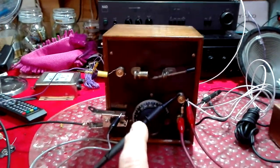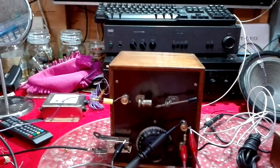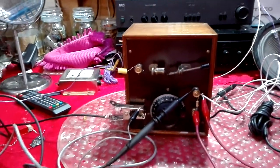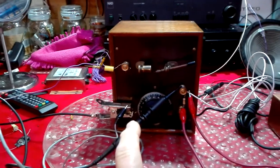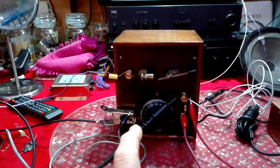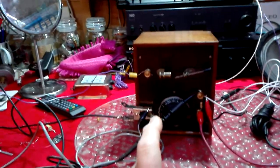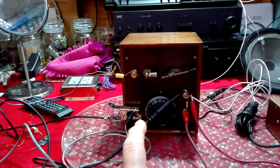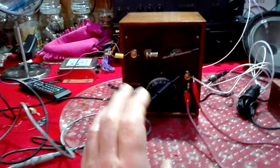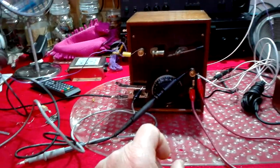This set has actually got an ALD110900 ePad chip in it at the moment and it has a 1.5 volt battery in series with it. We've discovered that putting a battery in series with the output from the unit to the headphones actually increases the signal level on strong stations. It doesn't really affect it so much on the weaker stations, but certainly on the strong stations it comes way up.